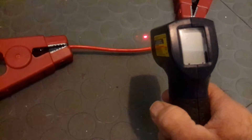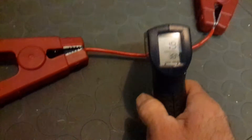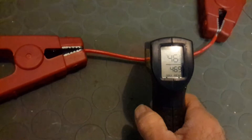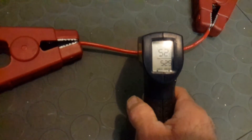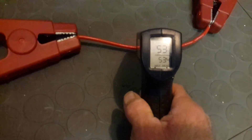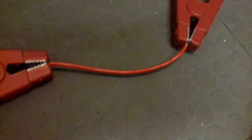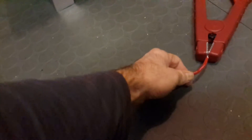You can see no smoke — I can touch it, it feels barely warm, I'd say about 40 to 45 degrees Celsius. With the infrared thermometer: 50, 51, 52 — it's slowly increasing — 53 degrees Celsius. So as you can see, for a substantial period of time you can carry at least 100 amps in a 10 gauge wire.